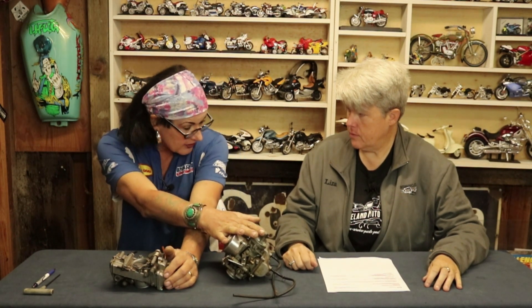So I pulled off the carburetors from my KZ400. Would you say these are just typical carburetors you find on many carburetor bikes? These are representative of CV carburetors — constant vacuum or constant velocity carburetors. And this is an example of a pumper carburetor, so we can examine the differences between the two.